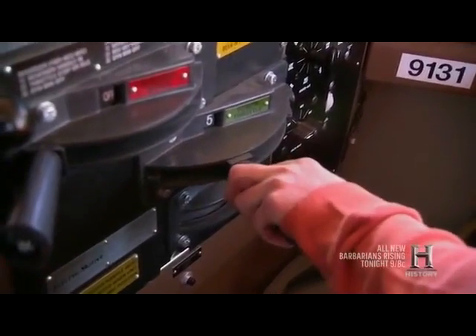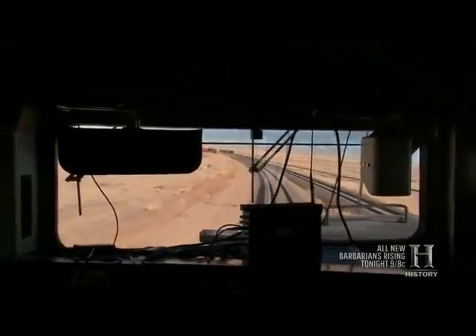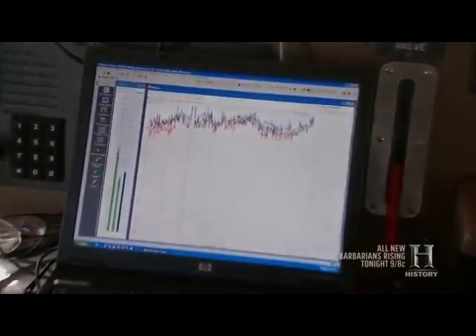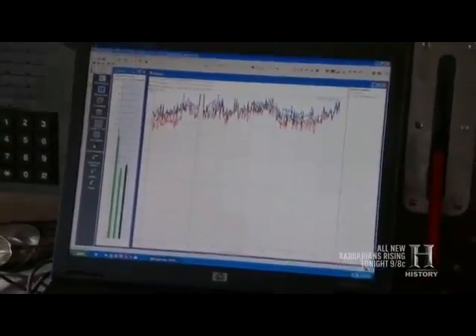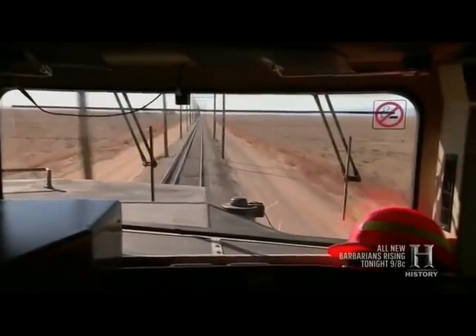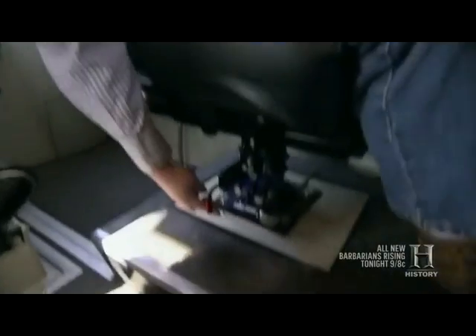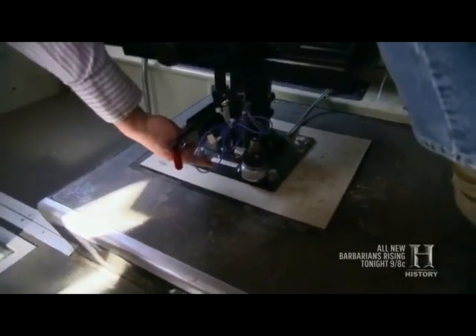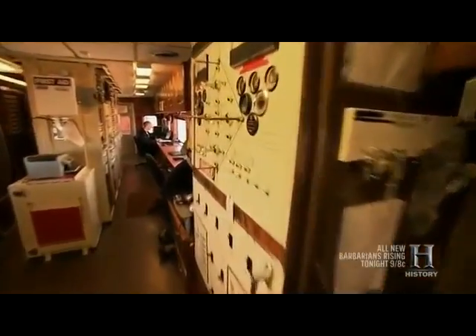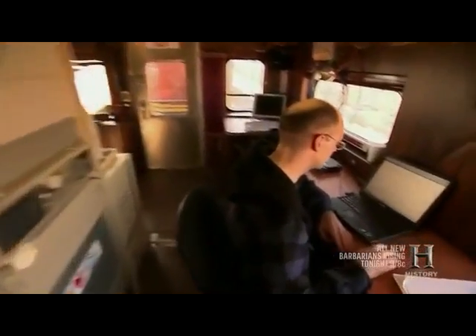It's time to open up the throttle to see if the isolated mounts work. Even at full throttle, the sound level barely exceeds 75 decibels — about the same as a normal conversation between two people — a victory for the EMD designers. The crew is also collecting ride quality data by testing the cab for vibration. The whole cab has sensors all over it measuring cab seat base vibration in all three directions: up and down, fore and aft, side to side. Technicians record the data in a test car behind the locomotive, and EMD will use it to develop even more ways to improve their locomotives.